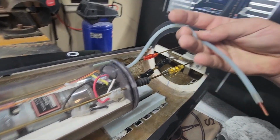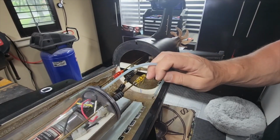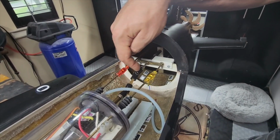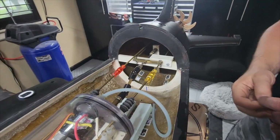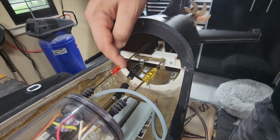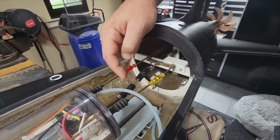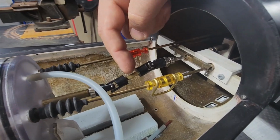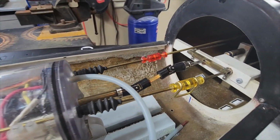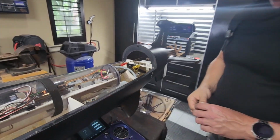Dwayne's also got this set up for a little test hose so you can test the watertight integrity of your watertight cylinder. And we got a double U-joint connector in here. And the neat thing about this, by the way, is that with this being magnetic, this is actually a slip shaft in here. So you have a small rectangular shaft in this, a large one in that, and they nest here. So when you pull this out, it just comes right apart. You don't need to undo any screws or bolts or anything like that.